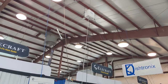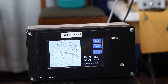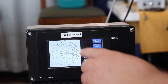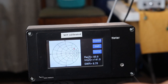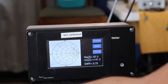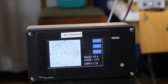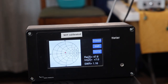This is the vector network analyzer. We can see it here — I'm going to take it out of resonance, bring it down a little. We're at SWR 6.7 and it's bad. Now if I just bring it in — watch the red dot — bring it in, you see it going around the SWR circle... too far... there we go, right on 50 ohms, SWR 1.1 to 1. That's all you've got to do.